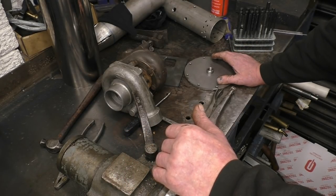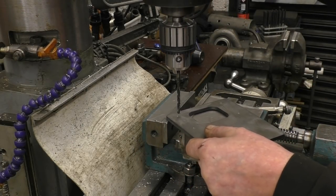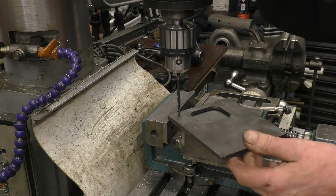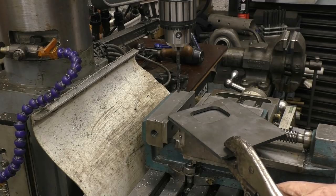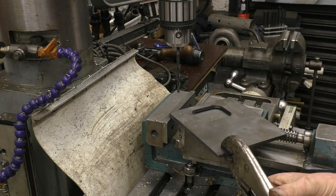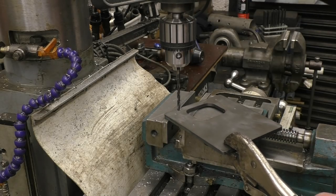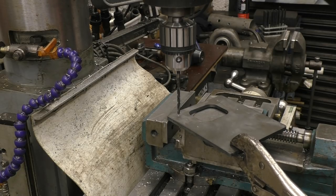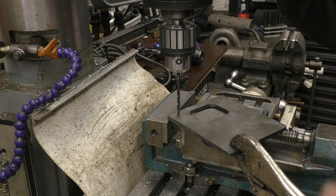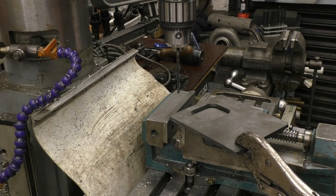What you want to do is try and hold the part like that when drilling, because it'll snatch - if it snatches it'll cut your hand open. Either you clamp it down or you use something like that. I know for a fact that I can comfortably hold that without it snatching and pulling my hand in. I'll always have the belt run a little bit slack when I'm drilling holes anyway, so the belt would slip. Rightly or wrongly, that's the way I do it and the way I'm going to continue to do it.